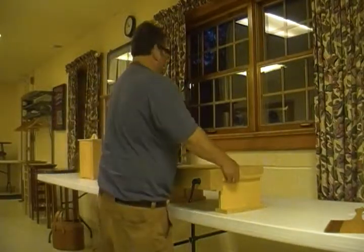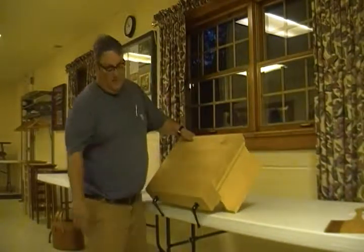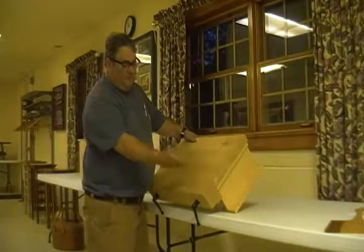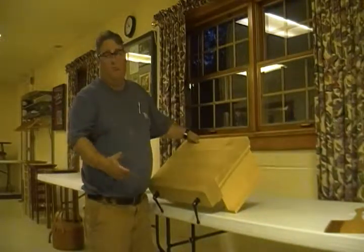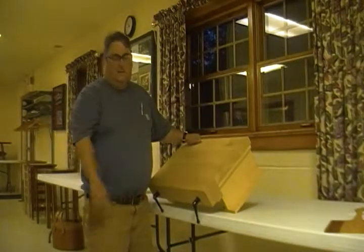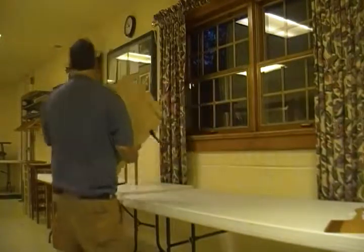That's it. Right. Oh, and I don't know if anyone else did this, but I actually drew my favorite dovetail angle right on the top of it. So every time I get ready to do a set of dovetails, I can just put my bevel square on the top of the bench and set it to 1 in 7. Nice.